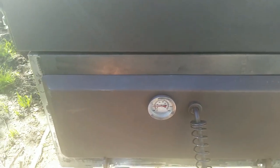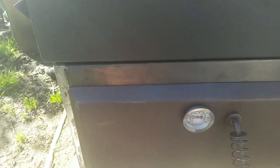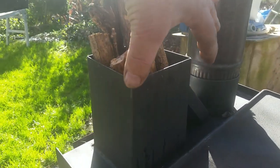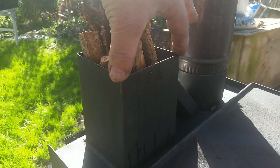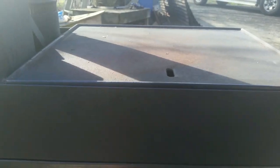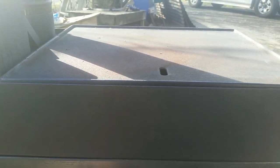The only other option is to hot-rod it and turn it from a Nova number four, which is four inches across, to a Nova number six — put a six-inch feed chute in and a six-inch firebox and really get the thing going, but the problem then is I'm going to have too much heat on the top.